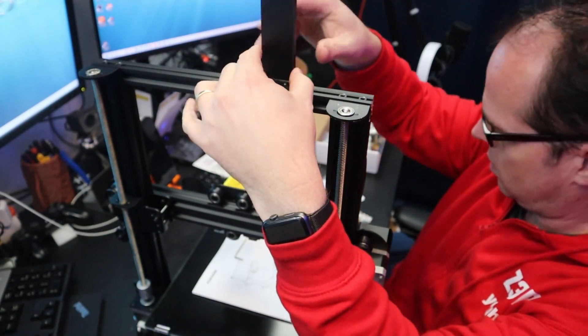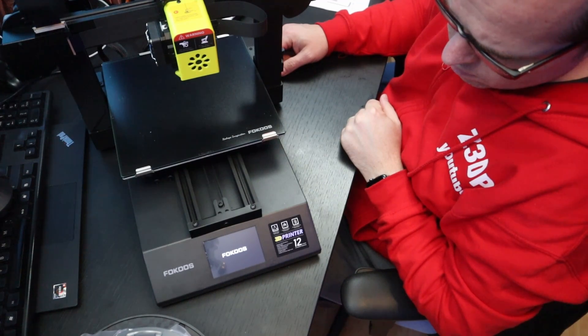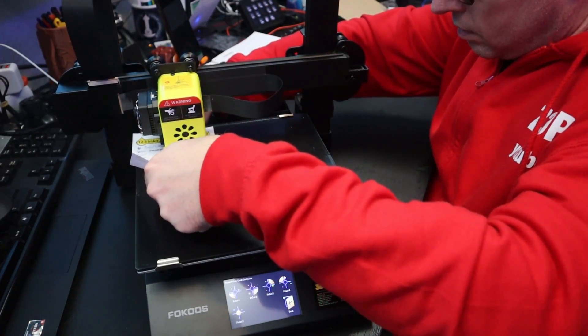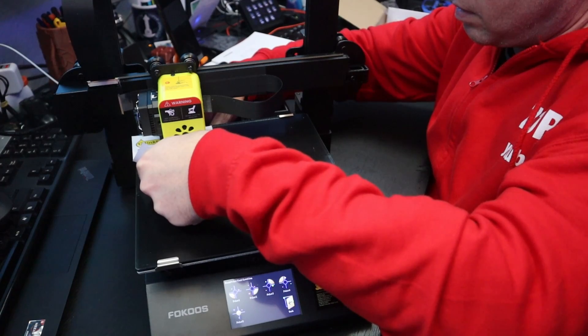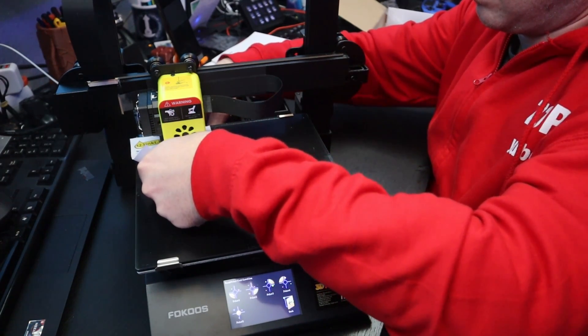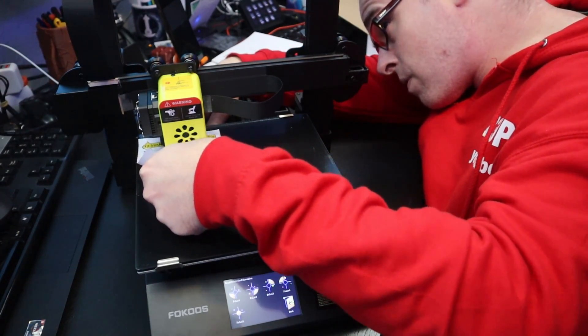I checked if everything else on the 3D printer looked fine — the movement seemed right and felt right. For the heated bed frame there was a V-slot wheel I had to adjust a little, using a wrench and eccentric nut until everything was sturdy and moving smoothly. I started up the printer, checked the Y-axis, X-axis, and Z-axis movement — everything seemed to be working fine. I was thinking: 99 US dollars, only a broken bracket and a bent lead screw bracket — that is cool.